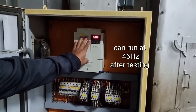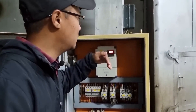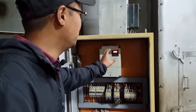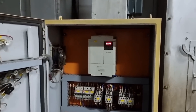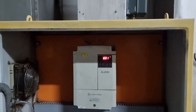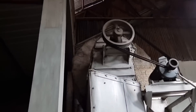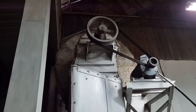I have run this at 56 hertz as well. Let's start it up so you can see how smoothly it starts the motor. You can see a gradual increase in frequency, and the motor itself has no stutter during the start — it's a completely smooth start.